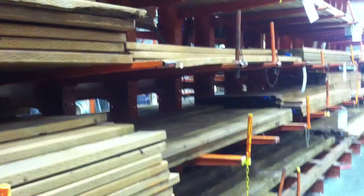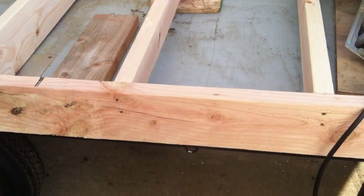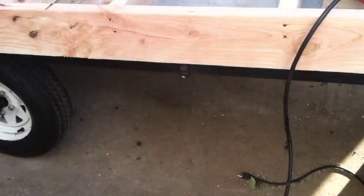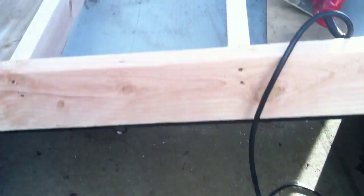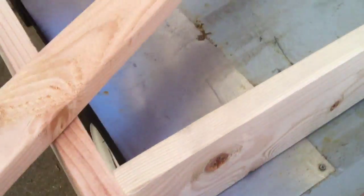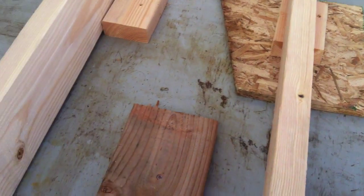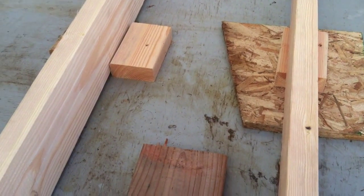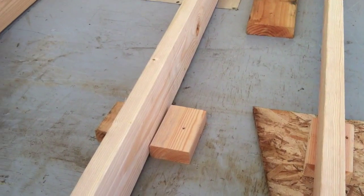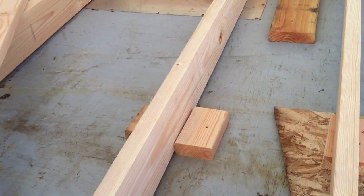What's going on here: I'm building the framework of the building on the trailer. The trailer's flat enough that I can use it as a layout table. Even though it's tilted, it's a ten by five and a half, so we've got some overhang on both sides. I've got two by six stuff that acts as enough support. I've screwed down these spacer blocks to prevent it from sliding around so that it doesn't just fall off going down the road — they're screwed into the deck.